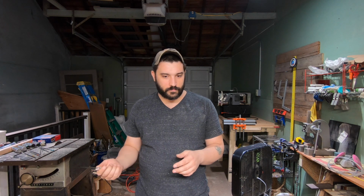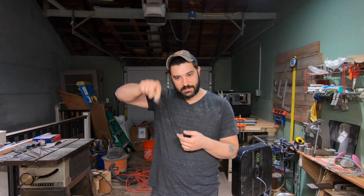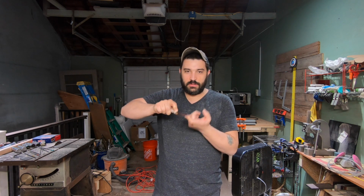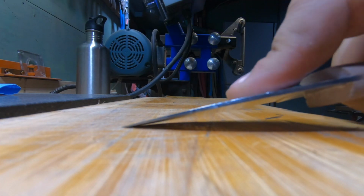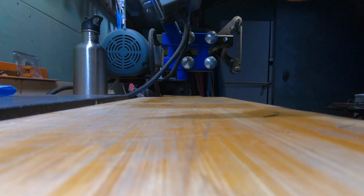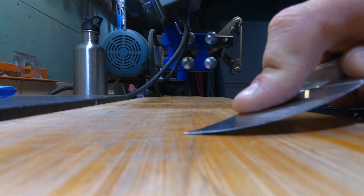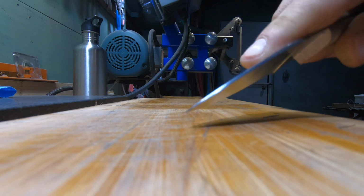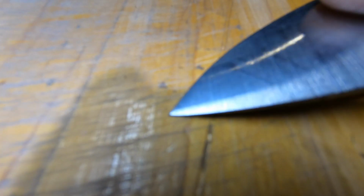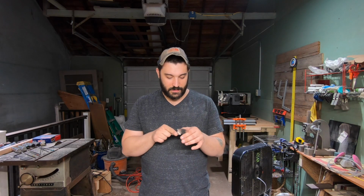I did do a little, and I'll show the clip, I did try to do a little ductility test. It's pretty solid. It bends and can give. It's a very solid knife for how thin it is. So again, that goes to show that I didn't really disrupt any of that grain structure and weaken the steel. I merely just lost a ton of carbon and suffered a lower hardness.